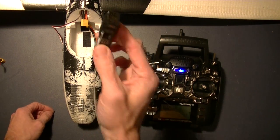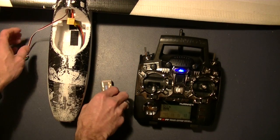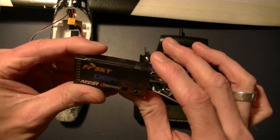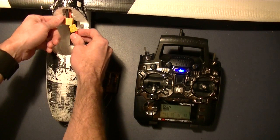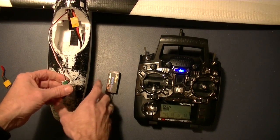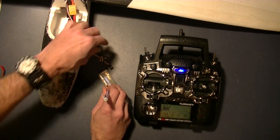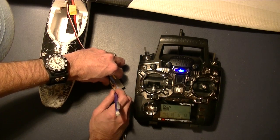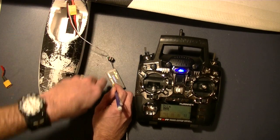The next thing I want to do is plug my receiver into bind mode. The way you do this is hold down the fail safe or bind button at the same time that you provide power to the receiver. The easy way for me to do this is to go ahead and provide power to the ESC, because plugging in the battery takes a little more dexterity. So with this flat on the table, I can just hold down the button with a pencil. Let me make sure I know my polarity, and then with the ground up, plug that in.